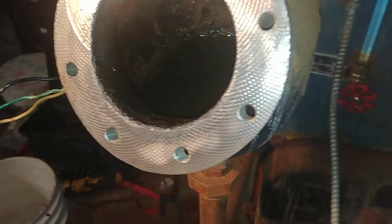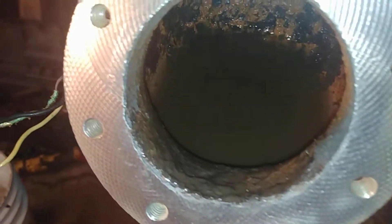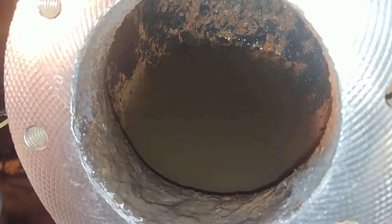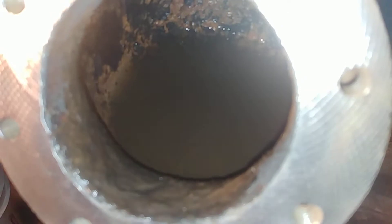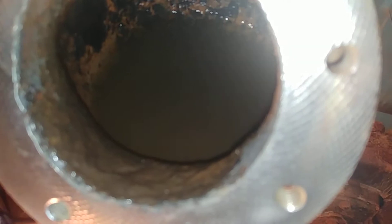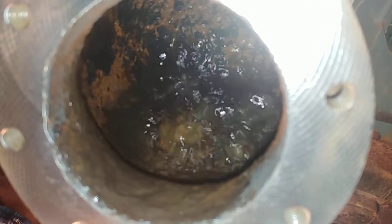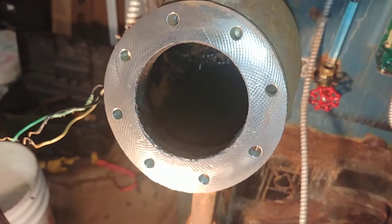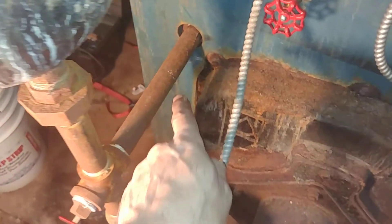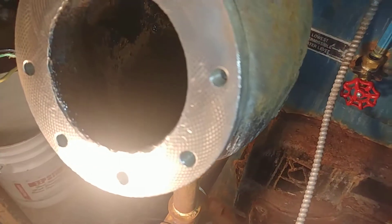What I wanted to show was the procedure on dumping the water. I'm going to keep the camera on the water and my able assistant is going to open it up. You see the water level drop and he shuts the level and it pops right back up. If you do that a couple of times — you don't want to just hold the lever down and let it run — because what's happening is the water simply is running out and you're not really getting good flushing action.